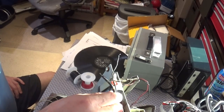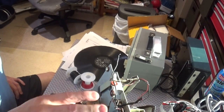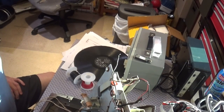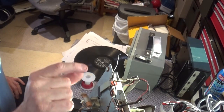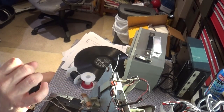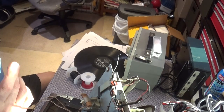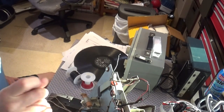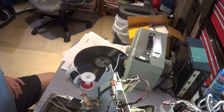back to the chassis. And I also understand that the nature of how this amp or this turntable works is it shorts out the wires when it's not engaged and not used. And when you initiate the mechanism, it'll unshort the wires, right? So that's how it works. And I was able to prove that. Don, a junk collector, said, "Hey, Ron, short out the wires that you're getting the hum from, and the hum will stop." And he was absolutely right.